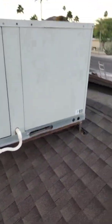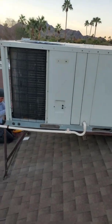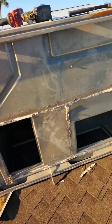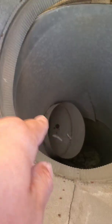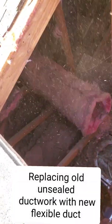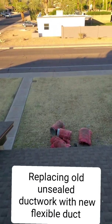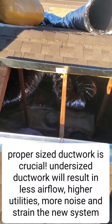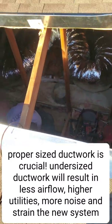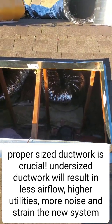We'll take it apart step by step. We got it all taken apart — there is the old AC turned on its side, there's the opening. All of this is coming out, including the old ductwork; it's not sealed at any joint. We're replacing the piping that's wrapped with insulation with flexible duct. Here's the new jack in place and they're replacing the ductwork inside — you can see the new one, so now they'll have a lot more return and more ductwork on the right side.